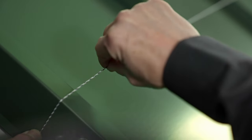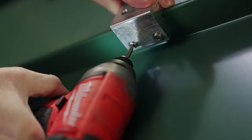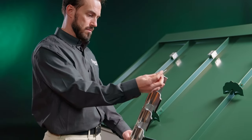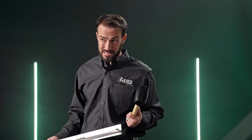Once you have all your parts, the clamps get installed first using a chalk line. Then you install the clamps. Next, you prepare the rails by sliding on one snow clip for each panel and one versiclip for each clamp. A quick tip: gently slide these on, because if you force them or try to hammer them on, you'll damage the aluminum and they won't slide at all.